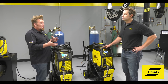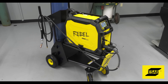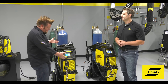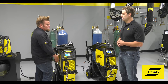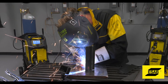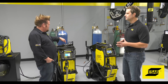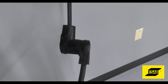Aside from just being larger, what's the difference between these Rebels and the other ones? As you go up in size, naturally you can run larger diameter wires. The 235 is obviously a higher amperage machine and fits the 33-pound big spool. That's optimized for 035 wire. If you jump up to the 285, that's optimized for the full range of 045 wire — bigger, better brother. More industrial — big time industrial. Multi-process, spool gun, TIG outfit — the full multi-process capability. And dual voltage.